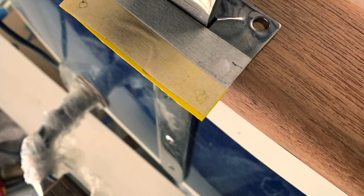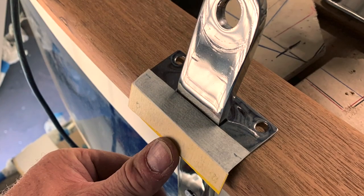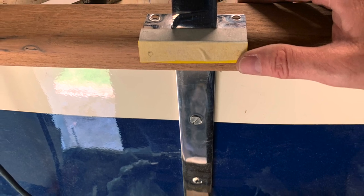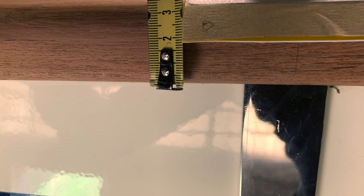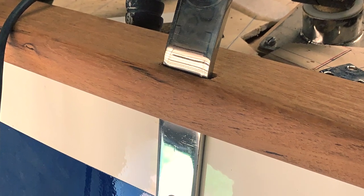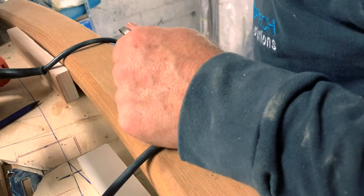And this is the hole that I did, and this is the original cover that was installed on the chain plate. You can see it doesn't fit very well my new capping rail, so I need to make a brand new one with a small curve that follows all the contour of the capping rail. So I need to take some measurements and ask Andrea to make one for me. You have seen the final result, but now I will show you all the work step by step.